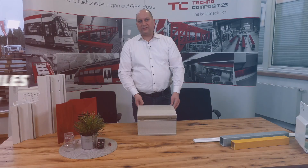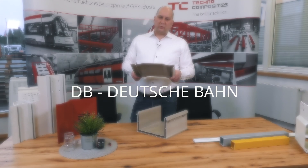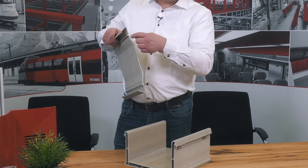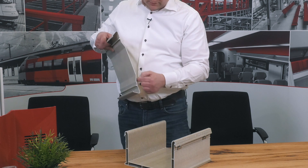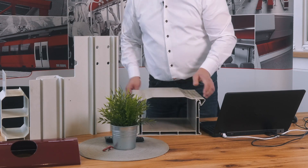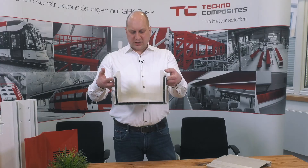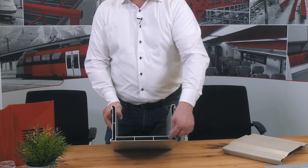If we look at our new glass fiber cable tray — it's a tray and also a cover — you can imagine that with these glass fiber profiles you need to put all the glass fiber mats and rovings in the right position. So you have to make sure that every glass fiber roving is going to the right place, and also the mats. It's very necessary that the mats go around the outside area to make sure that the glass fiber profile is strong enough. Looking at the channel itself, with some hollow chambers — we have here one, two, three, four, five, six, seven hollow chambers — and a complicated shape. In that case it's very complex to manage the positioning of all the glass fiber rovings, the glass fiber mats, and also the veils.